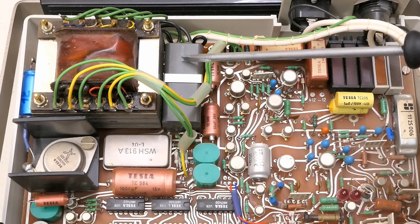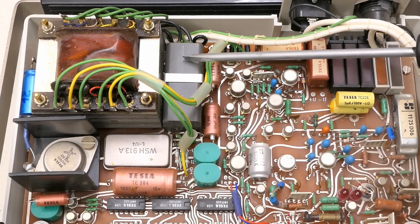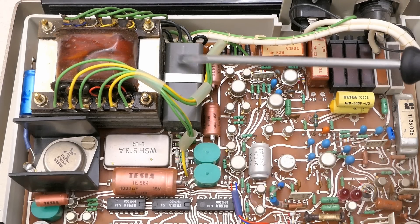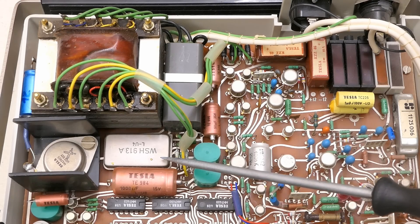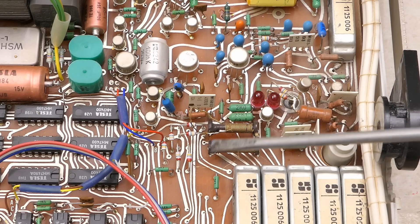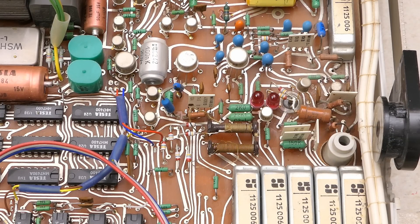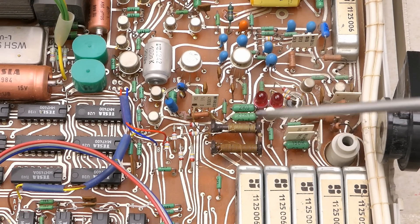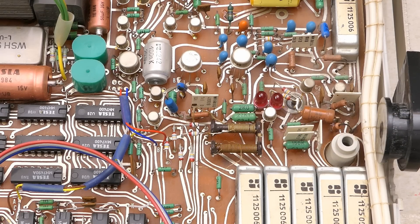Here is the power supply with this interference filter containing a paper capacitor, which likes to explode. This thing has to be replaced preventively. These plastic-housing electrolytic capacitors maybe should be replaced preventively too, but this filter is the worst thing in it. And this plus and minus 15-volt symmetrical regulator is a hybrid circuit — also notorious for being unreliable, but in this one it still works. I guess this multimeter wasn't really used that much. And some wire resistors with wires hanging from them — they were basically shortening the resistive wire until reaching the desired resistance. These are the current sensing resistors.